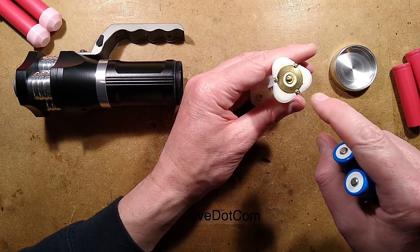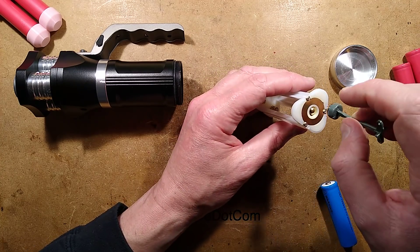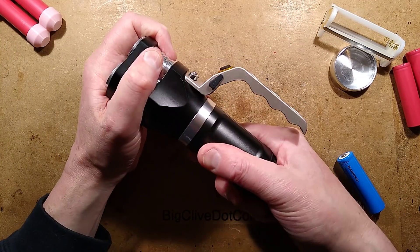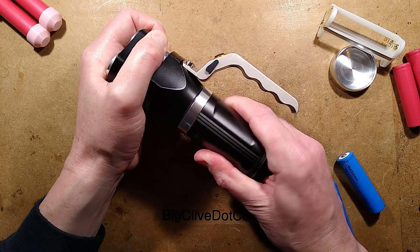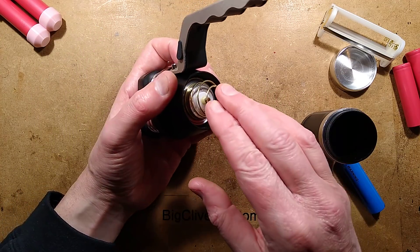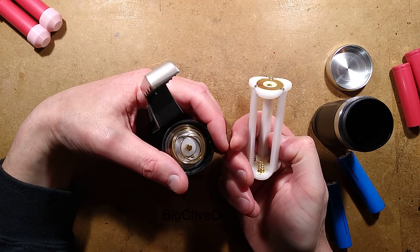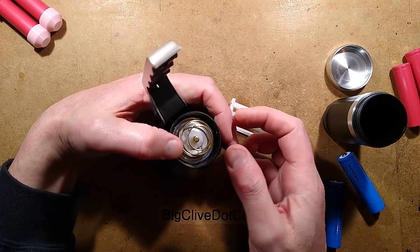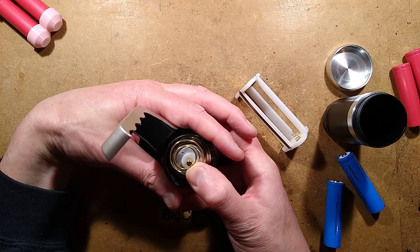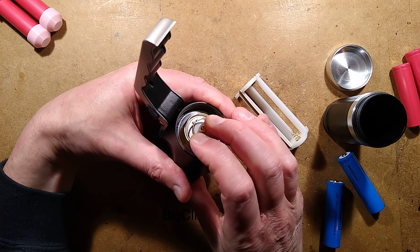Three batteries. An interesting construction — the outer ring is the negative and the inner ring is the positive. These brass-like contacts readily accept magnets, so they're actually steel with a little hint of brassy colour. The whole construction of this is lovely in the sense that it's designed with that general machining look. This comes off as well with that decorative ring and an O-ring, and that reveals the contact end. One thing I have a slight reservation about is if you put really high capacity, low internal impedance cells in this, then it could potentially, as you put this in — if something went wrong — this spring can theoretically bridge onto that contact. Hopefully it would go down nice and square, not skid to the side.